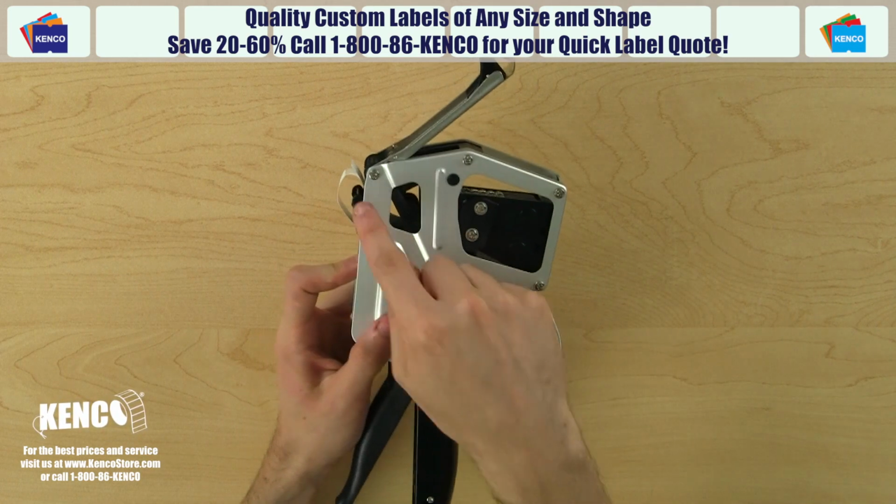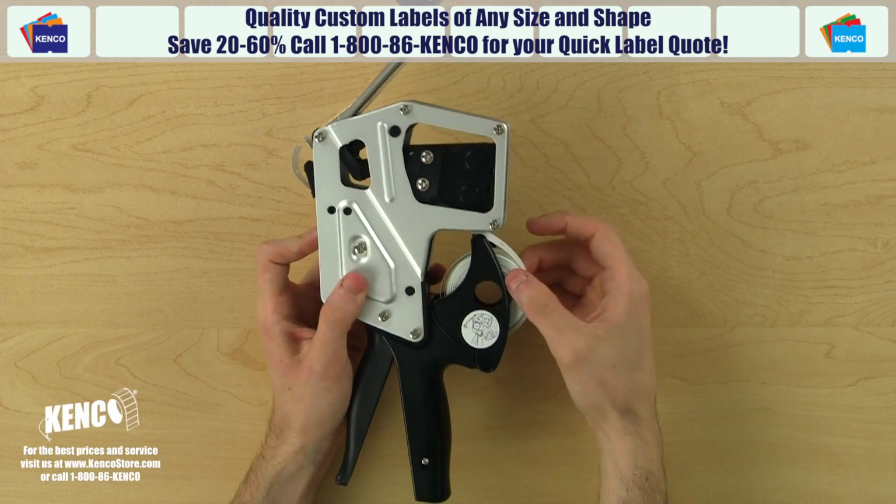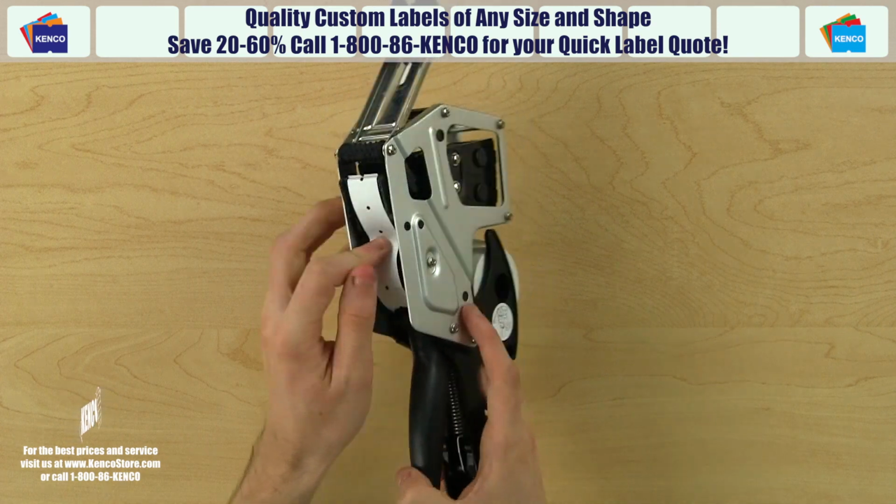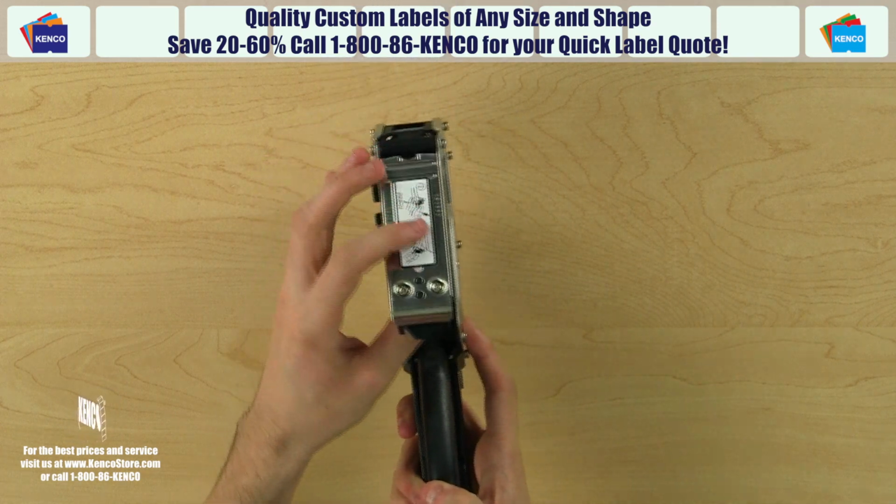When you rest the labels on the advancing mechanism, line up 2 of the holes on the labels with the sprockets. Sometimes we have too much slack here. If you do, hold the labels against the advancing mechanism with one hand and start rolling back the slack with the other until it's tight.